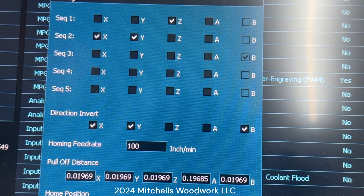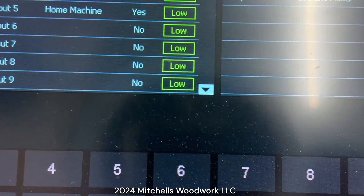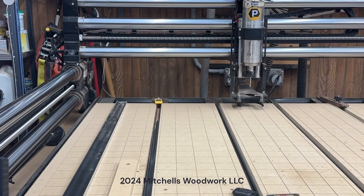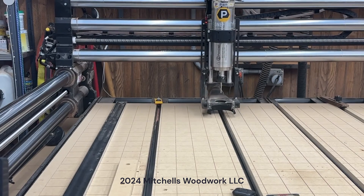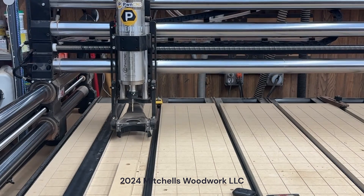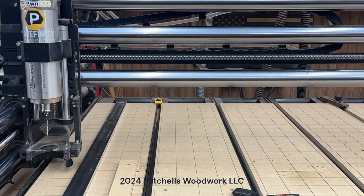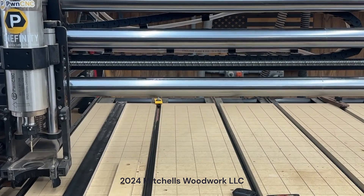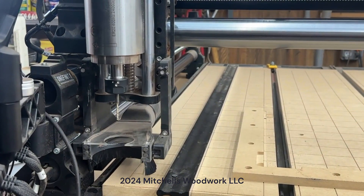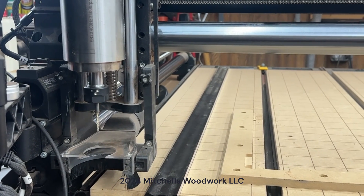Let's see how much difference this change made. Go down here and hit Save. Let's test it out — double tap to home the machine. Look at that: not only is the speed five times faster and still within the suggested range, but my X is coming over to the left at the same time the Y is coming forward. It just glided in there perfectly.